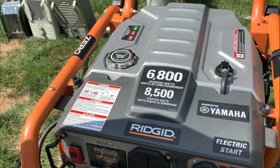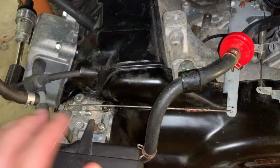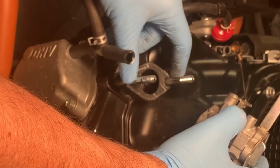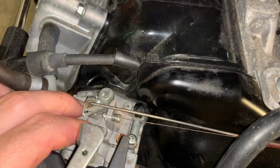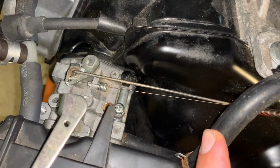It's been an hour or so since this was brought in, and I just want to review a few things real quick before I dig in. The carburetors always have a plastic spacer, and you can't see it right now because it's kind of under the shroud, but when I took the carb off originally, that spacer started sliding out with it. It's about an inch thick, and the sole purpose of that is to prevent heat soak from the engine transferring to the carburetor, causing it to vapor lock inside the carburetor. So I don't think that's the issue as far as the carb goes, because when I popped the line off, there was no fuel coming out of the line either. So it's not like it was here trying to get in.